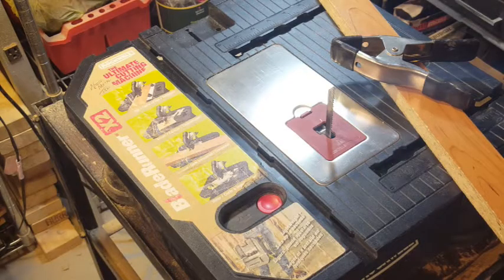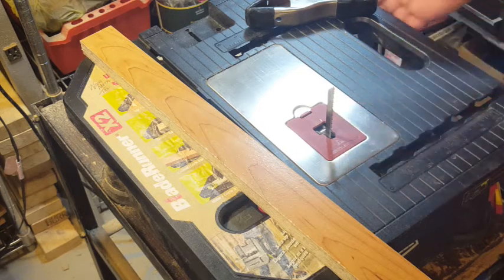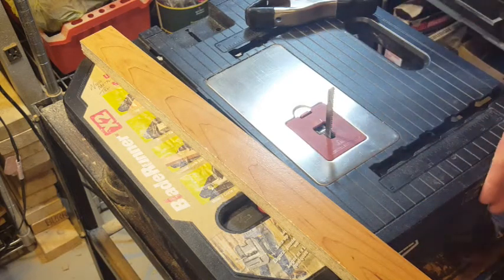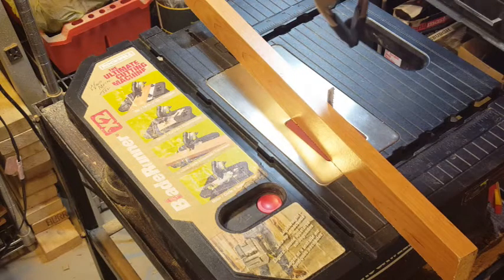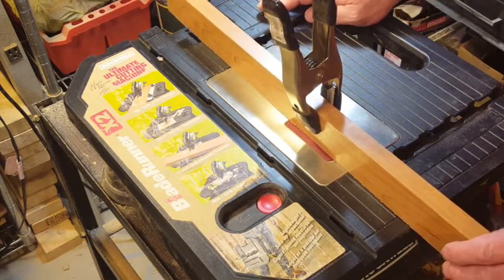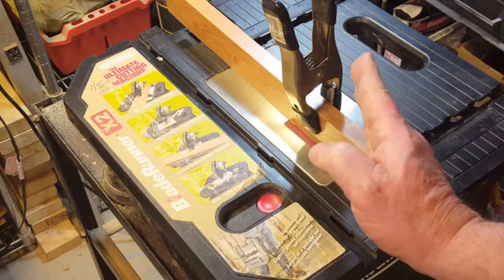So I decided to take a look and try to determine how this blade is sitting with the Blade Runner — is the wide part of the blade really parallel to the side of the table, and do I get a nice 90-degree angle with the front? I have a relatively flat, straight piece of wood. I'll lean it up against the blade and use a spring clamp, make sure it's not twisted, and then eyeball it. It looks like the blade is actually twisted.